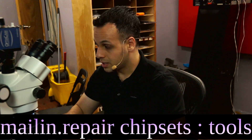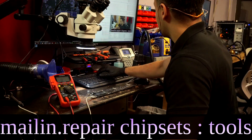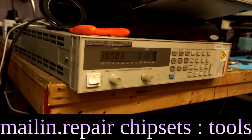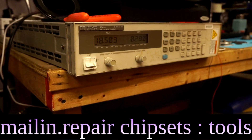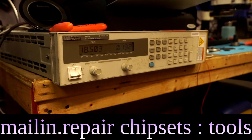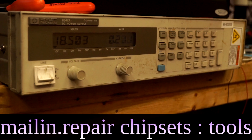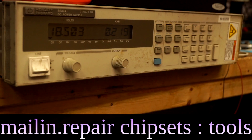So if I plug this in, as you'll see, it is dead. If I go over to my DC power supply, you'll see that I'm drawing about 200 milliamps — anywhere from 180 to 200 milliamps when I have it set to 18 volts. And it's dead.